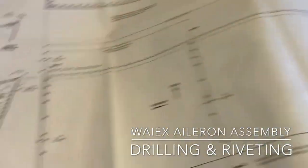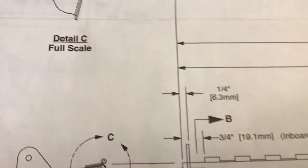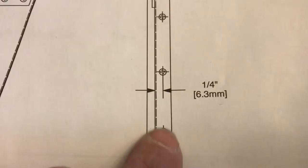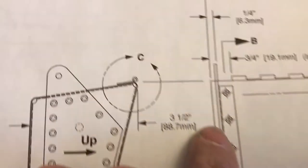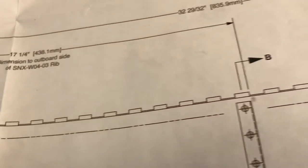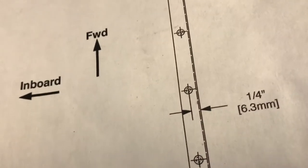My first step in this aileron assembly and marking the holes for the ribs is measuring in from the end one quarter of an inch to where the rib begins — it's actually on the inside edge of that drive plate. Then it's one quarter of an inch from the flat side of the rib to where the holes are, so a total of a half an inch from the edge is where the holes will be. The next rib along is 17 and a quarter inches to the outboard side of the rib.